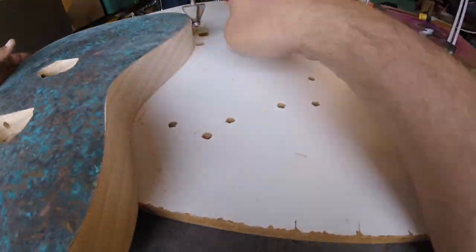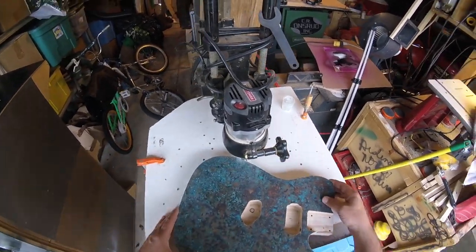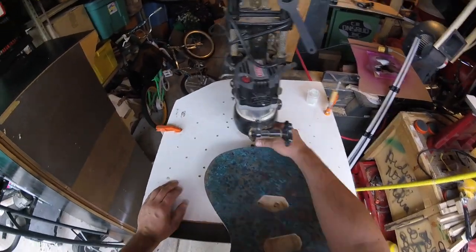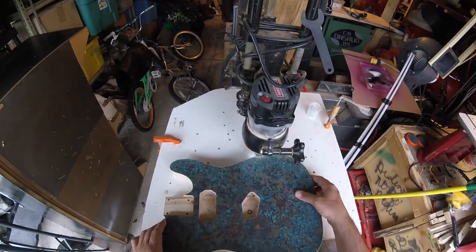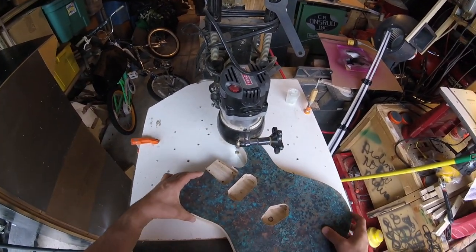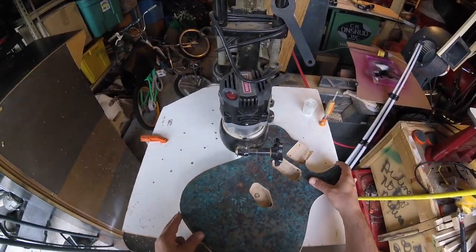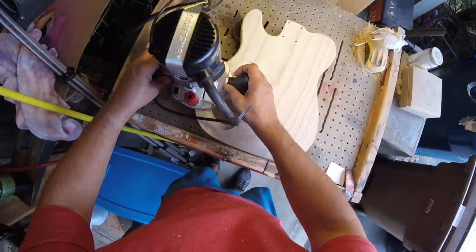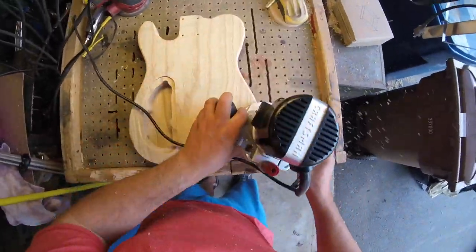For the top I don't want to do a round over — I've got a 30-degree chamfer bit. It's just an angle instead of a round over. My machine was vibrating here for some reason, but I made an adjustment and it was working fine. And again, this was cutting the copper fine. On the back side I'm just doing a quarter-inch round over.